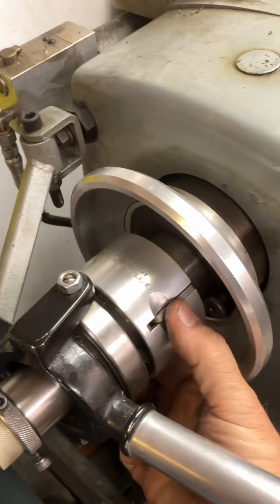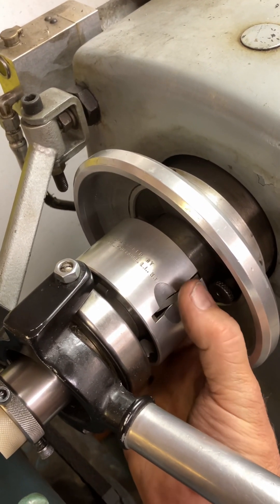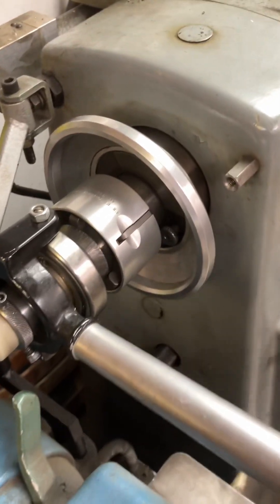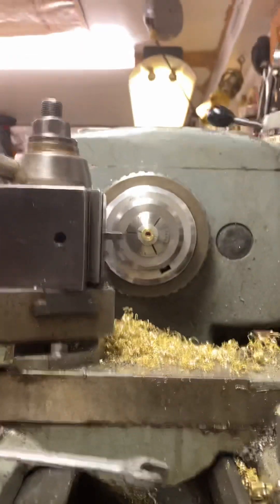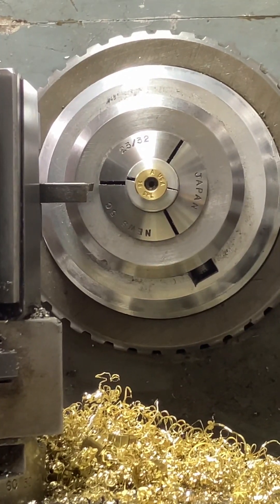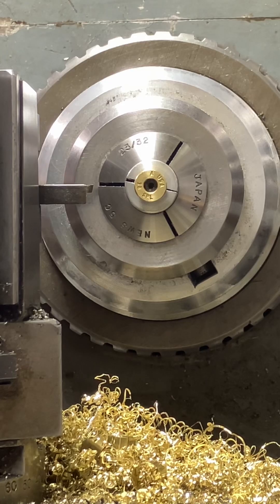There is this little locking lever here, so you adjust the tension on your collet here. Once you find the tension you like, you lock it down, put your part in, pull on the lever, and you are off to the races. I could go on and on about how much better than collet chucks these are, but instead of doing that, I will just show you.